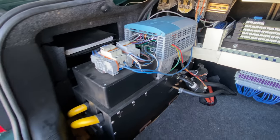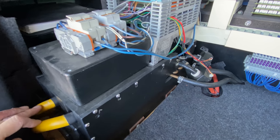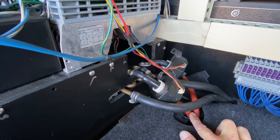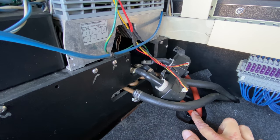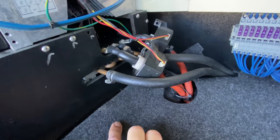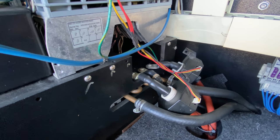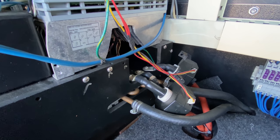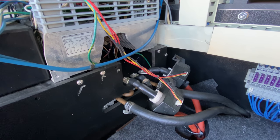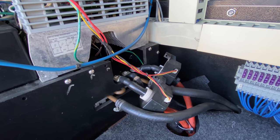Everything in the black box below is what I built. Those two yellow cables are the battery leads — that's 300 amps at 330 volts DC — and the orange cables are the three-phase power cables going to the motor. I have water cooling, so the two black lines are coolant lines that go to the chill plate that keep the IGBTs cool. Those two current transducers are used as feedback for the VFD to properly magnetize and control speed and torque of the motor.